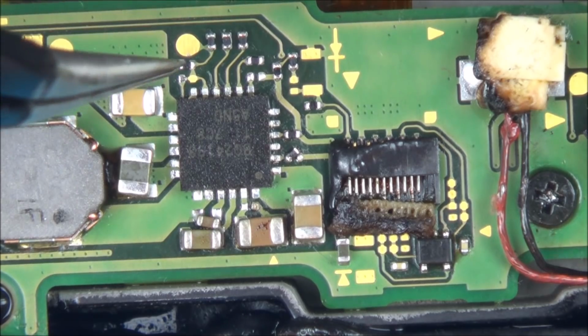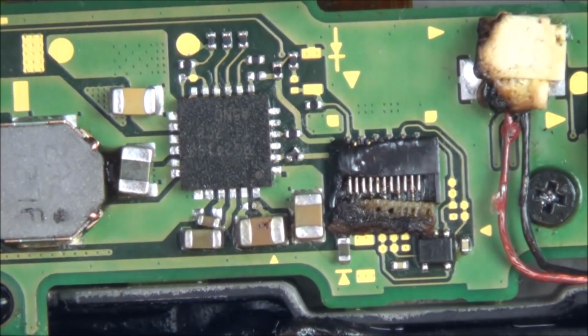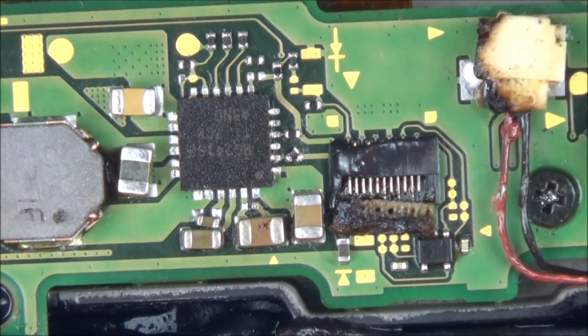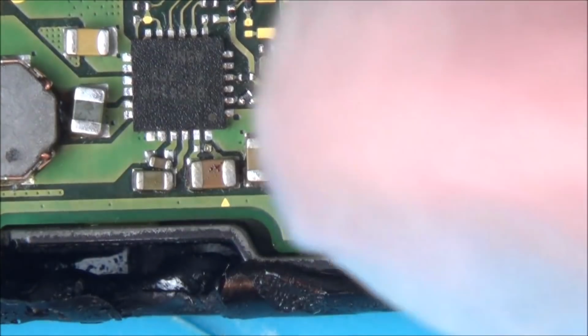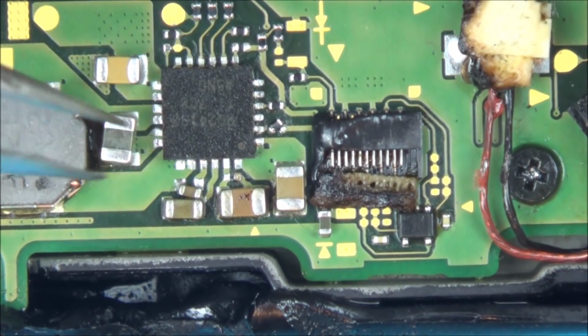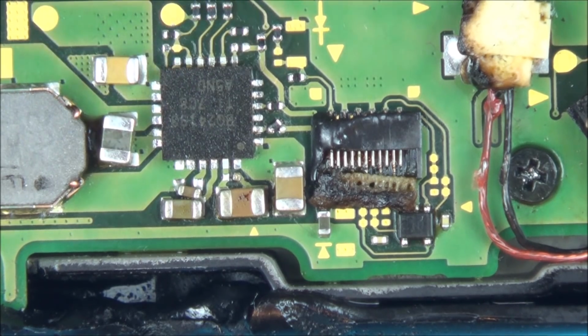Right, okay, quite a bit to do here. So what I'm going to do is, I'm not going to put Kapton tape anywhere, because even when I did, I melted everything anyway, and now I might have more control over what I'm doing. So I'm going to try to hold the wands in my left hand, which is going to be hard. I'm going to try to point the heat this way, and then rearrange a few things. I'm not even sure if I'm going to put flux on. I suppose I should put flux on, otherwise I'm just going to end up having to heat everything too much. Yeah, I'll put little bits of flux everywhere. I only need tiny bits.